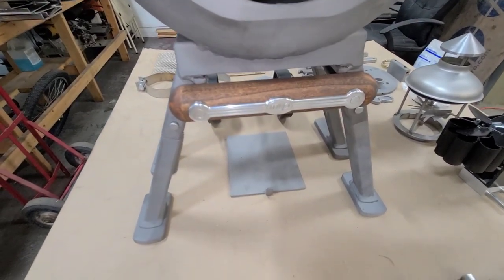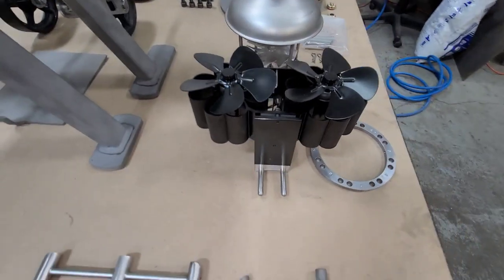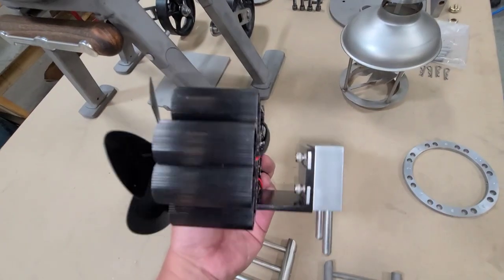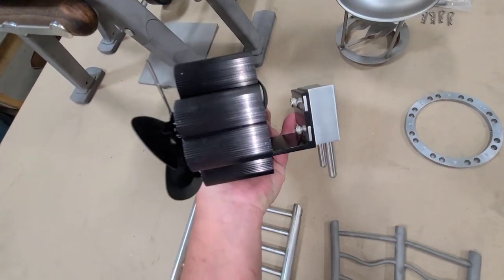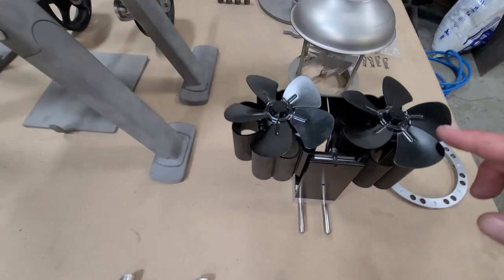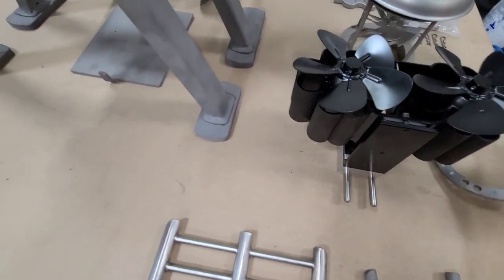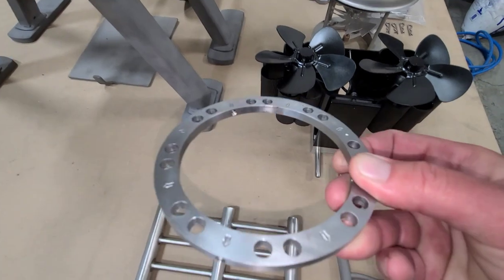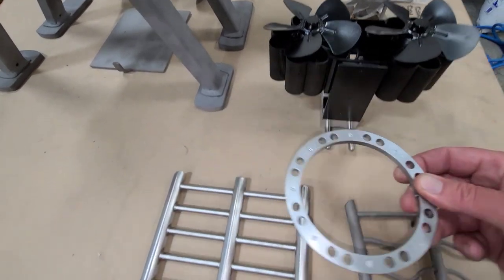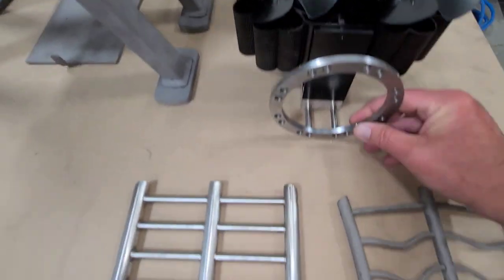Upgrade number three — I bought this heat-powered fan that goes on the flue pipe assembly, but from the manufacturer it came with a different mount using a big hose clamp. Since I use mine as a patio heater and don't want to leave it out in the rain, I need it to be easily and quickly removable. So I made this disc to go on the flue pipe with set screws on three sides, and it will pin into place whatever direction we want to point it.